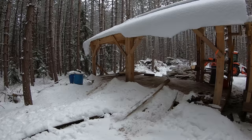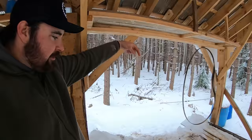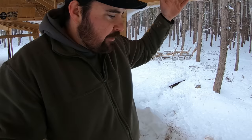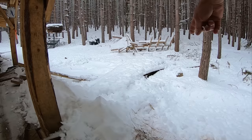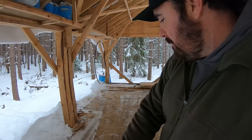During big heavy snowfalls I didn't have to trudge through snow to get beside the sawmill and shovel. But because of the steel roof, when snow let go it created quite a mess. The platform being two feet off the ground is kind of nice but not high enough — snow gets up above the platform and I still have to shovel it. My solution was to put a wall on the back, but then I remembered the sawdust has to exit. If I built a wall, the sawdust would hit it and constantly accumulate on the floor. So I decided to leave it wide open and shovel the snow out with the tractor.